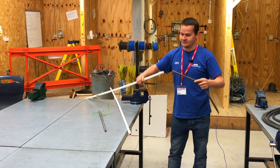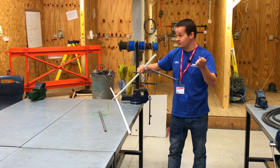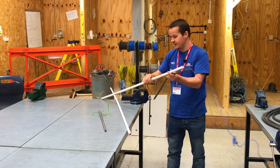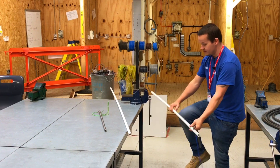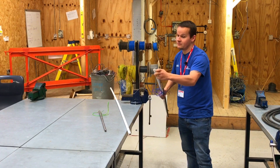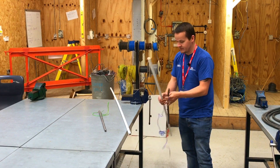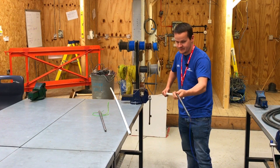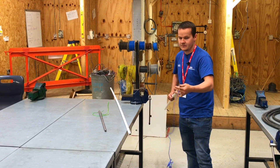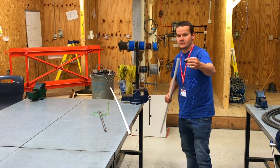If you've ever done plastic conduit, you put a piece of cable on there so you can see how long the spring is. Say you need to bend a 90 degree — you put your bending spring on there and then bend up to your cable, so you know exactly how deep it's going to go. And you're going for knee — not Superman knee — just your knee.